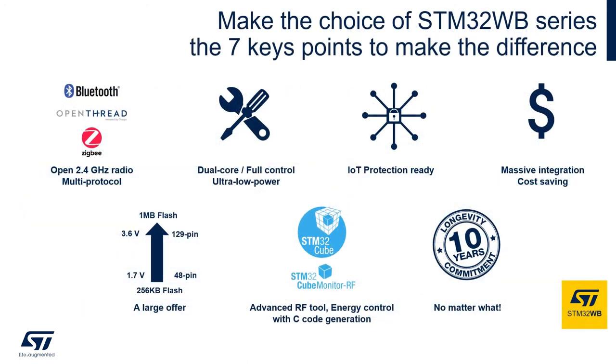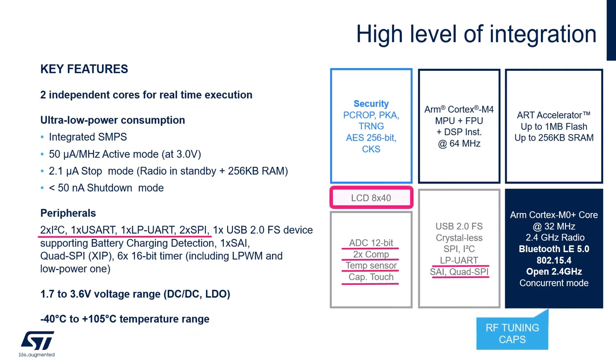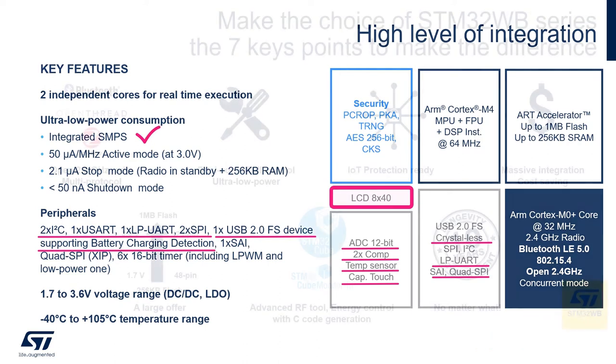When we look at savings, we integrate numerous peripherals including communication IPs, analog hardware, digital hardware, and RF tuning inside the STM32WB. USB Full Speed 2.0 crystal-less means there's no need for a dedicated crystal for the USB. In the RF portion we integrate a balun filter and provide crystal tuning capacitors to help with crystal variability across your design. Switch mode power supply integration allows us to drive down power consumption and save as much battery power as possible.